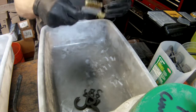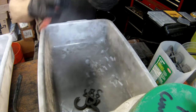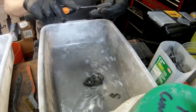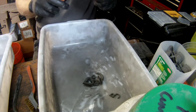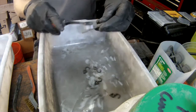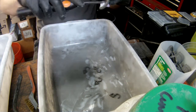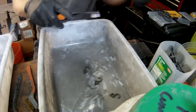The other benefit of using these outlines rather than standard settings is you get a much smoother surface — it's almost astonishing. If your outline is just the hatch, the hatch is lots of little crisscrossing lines that go to the end but it's not perfectly smooth. But if you use the outline as the outer boundary, it has that nice circular flow. So if you have circular or heart-shaped geometry like in this particular model, it just sinters really nicely and cleanly.